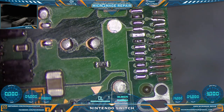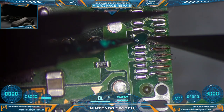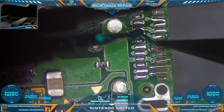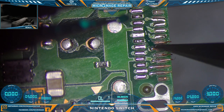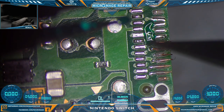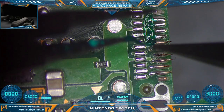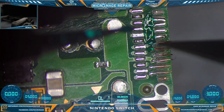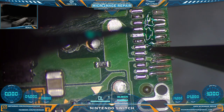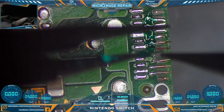Much better. Okay, we're going to apply some UV solder mask to secure these. What you really want to do is cover the joints, where it's soldered. I'm going to cover that pretty good. Don't worry about making a mess. You do want to thin it out, but not a big deal. You want to cover the solder joints because when you're placing the port, these will float. There's just no way around it.